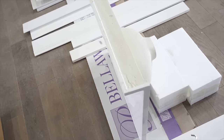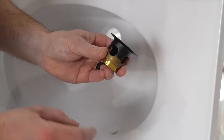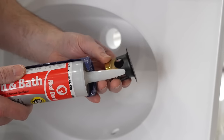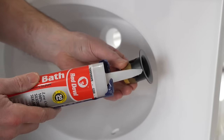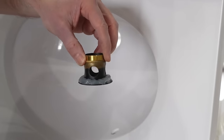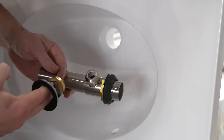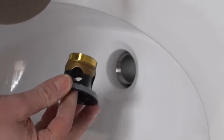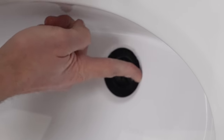To work on this by myself I propped it up on foam blocks. I'm first going to unscrew the top of the drain. You can use plumber's putty or 100% silicone around the lip — I've done videos using plumber's putty, but this time I'm just going to run silicone right around the rim. After placing a liberal amount around the rim, I'll take the drain piece, go around the back, and fish it down into the hole. The biggest problem with silicone is it always makes a much bigger mess than plumber's putty.